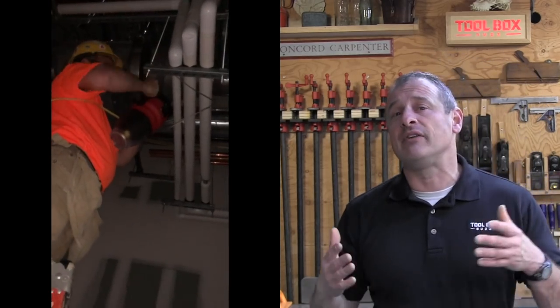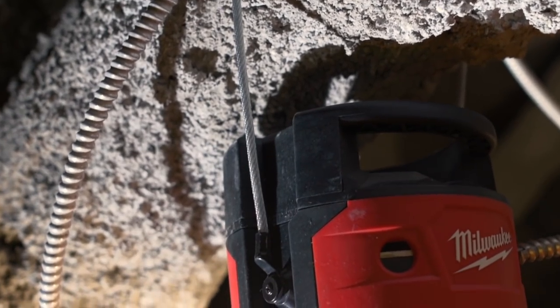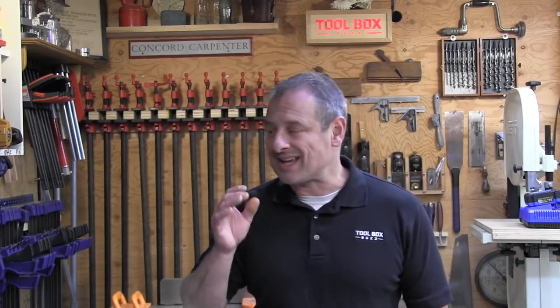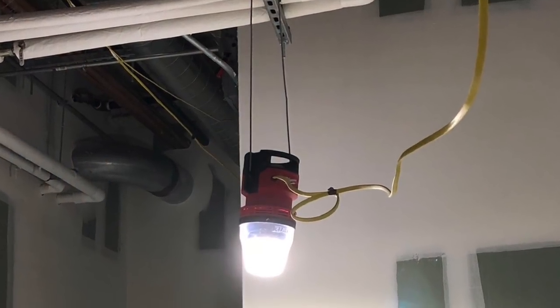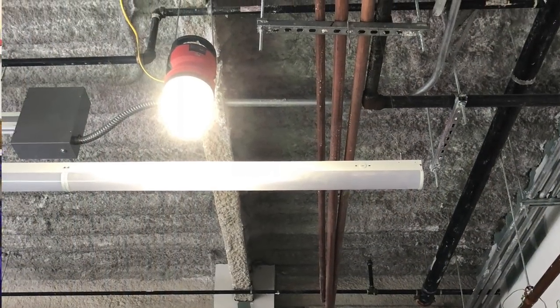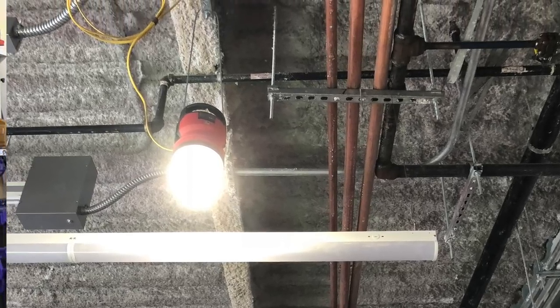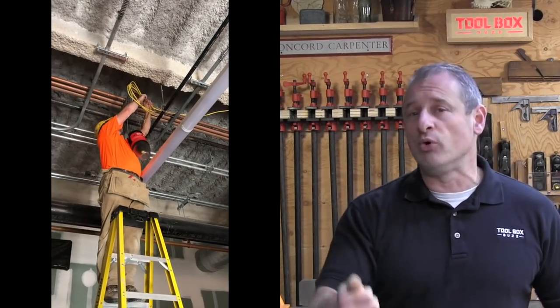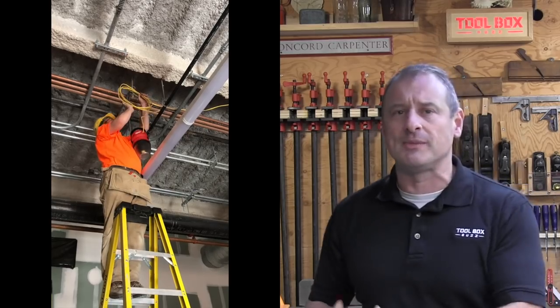The 2155 has a more substantial and rugged mounting system than anything else I've seen on construction lights. While I doubt you'll break the polycarbonate lens, it is replaceable. The light weighs 7.7 pounds and can take the wear and tear of a job site. No more busted bulbs, no more warm-up times — that's probably the biggest annoyance with metal halide. And these lights can be removed, stacked on top of each other, stored, and transported without worrying about fragile bulbs breaking.